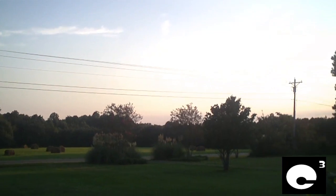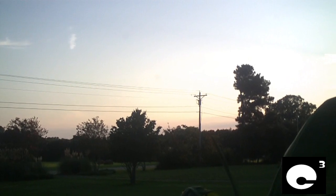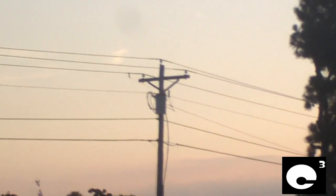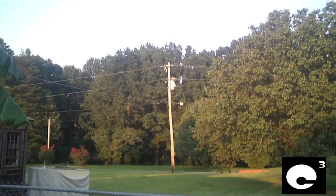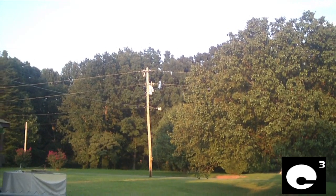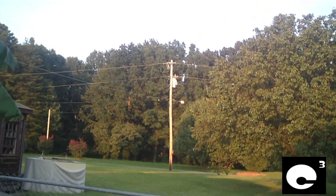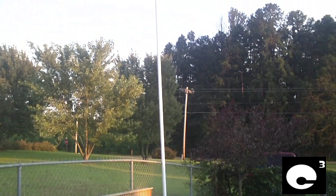As an introduction, in most cases if you live along a main road, you get fed straight from a three-phase line — such as right here, like our neighbor's house. It gets its electricity from right there, as you can see a transformer on the pole. In other cases, sometimes your electricity might be fed from a single-phase line, such as this right here. Most older neighborhoods and some regional main roads are fed off of single-phase lines, and these lines branch from the main three-phase feeder line.